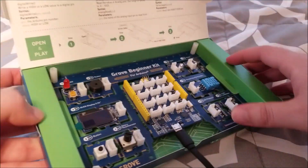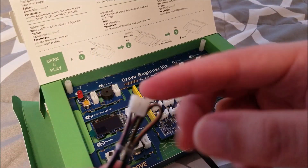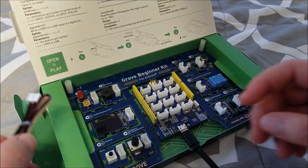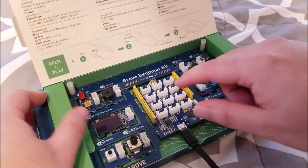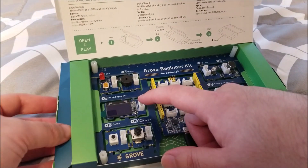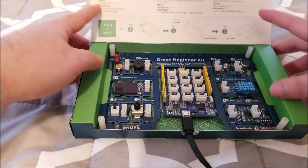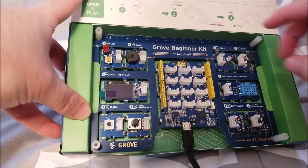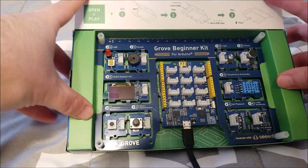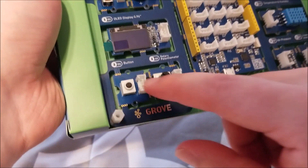On the other side we have all these spare cables — they're molex-to-molex four-pin cables, all with a little rubber band on them, nicely packed in. That's if you want to wire something externally to the headers, or if you want to break out each of the modules using flush cutters and wire them manually. Everything is kind of routed out, but there are metallic interconnects using vias for the break slots, and all the signals are routed through this PCB to the main controller.